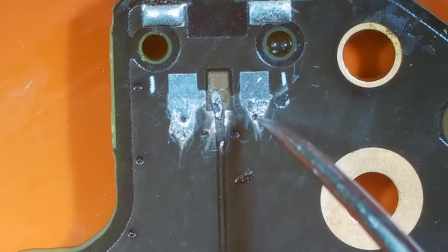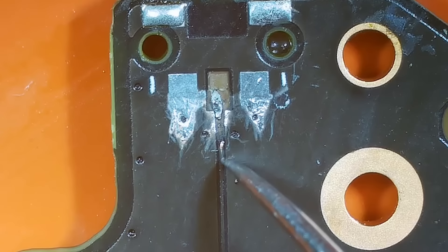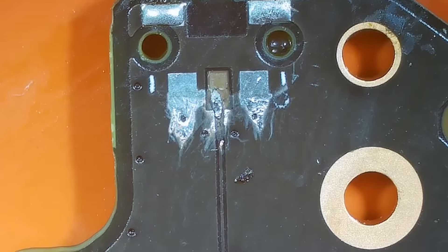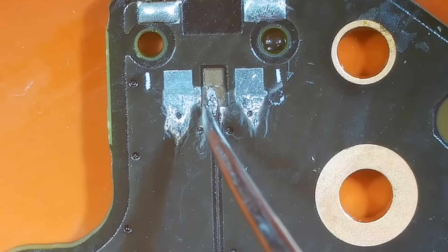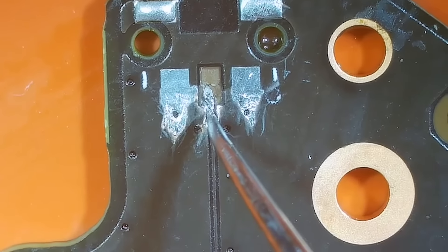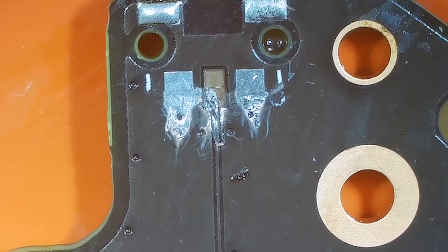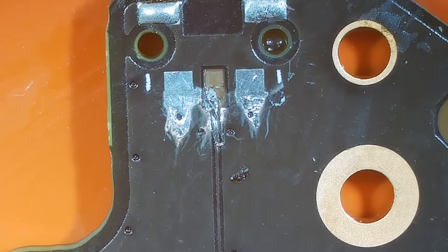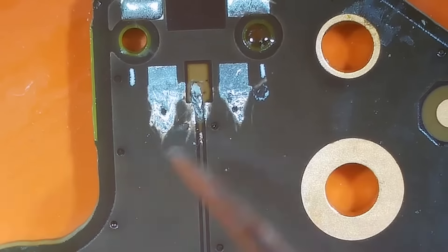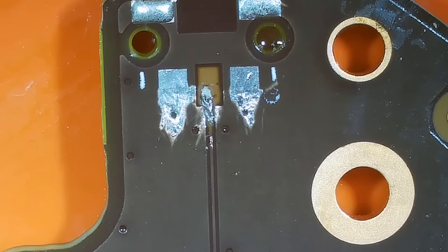So I think what we're going to do is mount a new button in there, solder these pins on, and then this pin down to this pad. Then we'll run a jumper wire from here over to this middle pad on the button. We also need to make sure this area isn't touching where it shouldn't be. I'm going to come in with a little bit more solder wick and get that solder up — I'll just feel better about it.